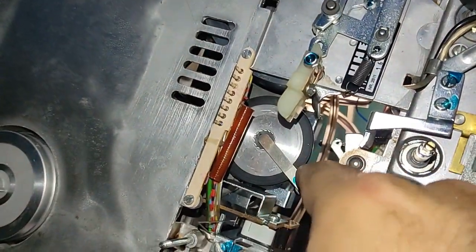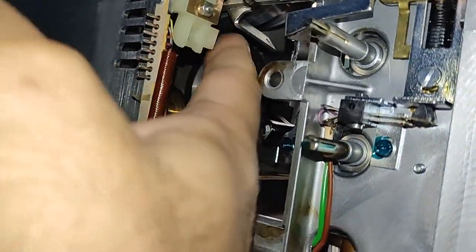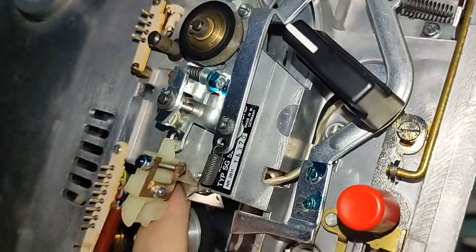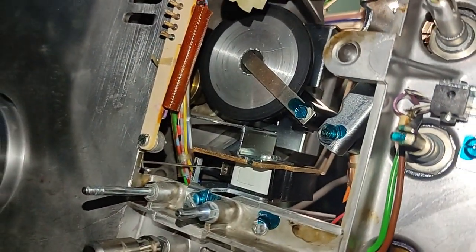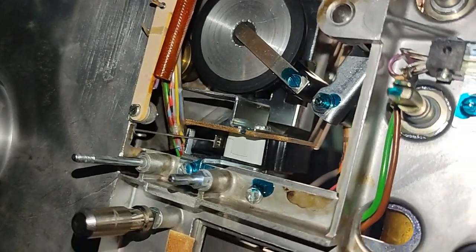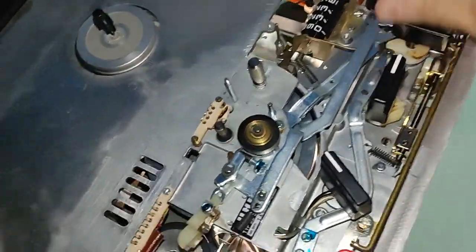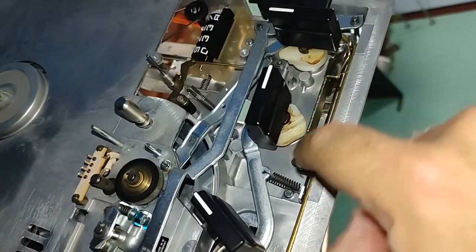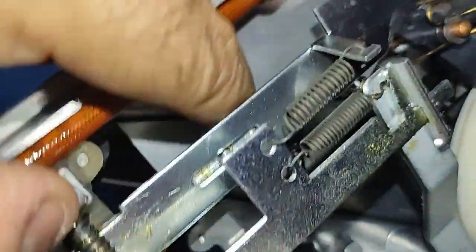what do we have at the front? Okay, this is the motor which is in there. This pulley here on the motor turns this, and then this goes to the flywheel, which is there. I move it now. This rubber pulley seems to be in perfect condition, and indeed we wouldn't lose any speed. Generally this machine is mechanically working okay. Some lubrication here and here also might be useful. Even the counter belt is nearly intact. Look, it's in great condition. It's like new. Everything is like new. This is amazing.